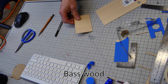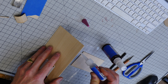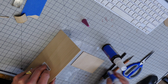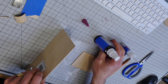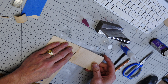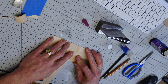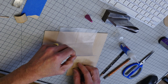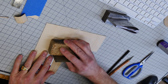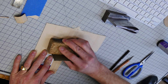Let's go cut out that piece of wood and get it ready so that when we have the actual file, we can laser cut it. I don't have a piece of wood that's big enough because I have to run the grain a certain way, so let's glue two pieces together. We use a little bit of CA — cyanoacrylate — and put a little bit of accelerant on the other piece, butt them up together, and get one big piece of wood with the grain going the correct way. I'm using a piece of basswood here. We add a little more accelerant to cure up the glue, then give it a quick sand so it's nice and flat with a minimal gap or seam.